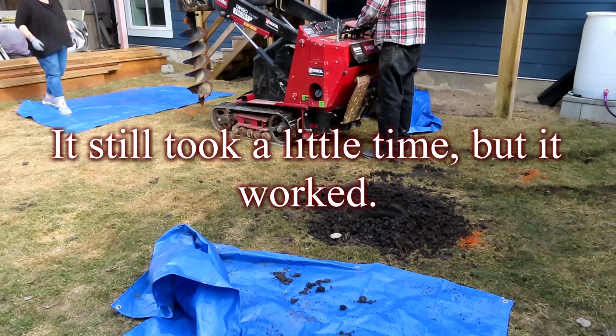Cut the bent aluminum sheets to length. Bend it at the bottom so that when installed, it will direct the water down at this point. I will be directing the water into an eaves trough. Lay the aluminum sheets between the floor joists and tack them on.